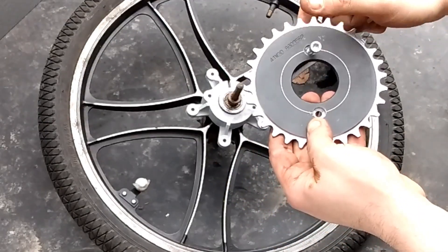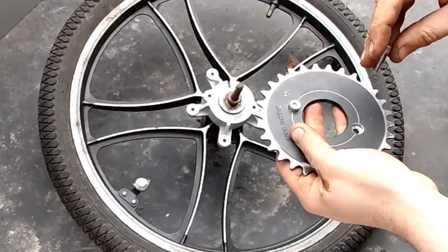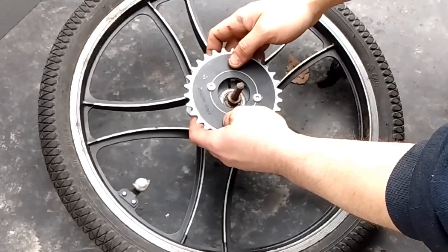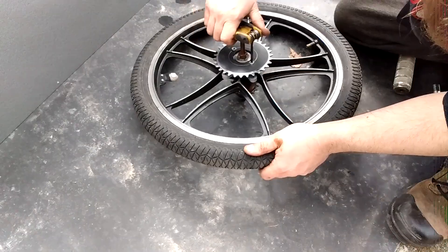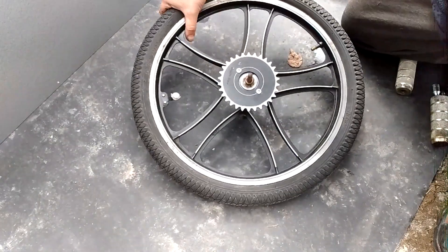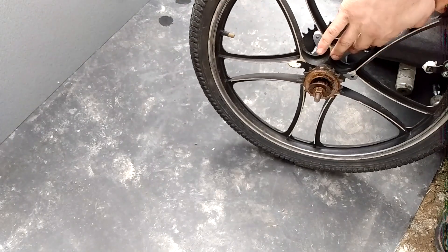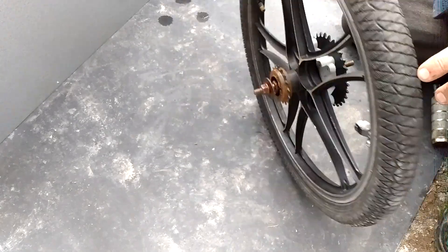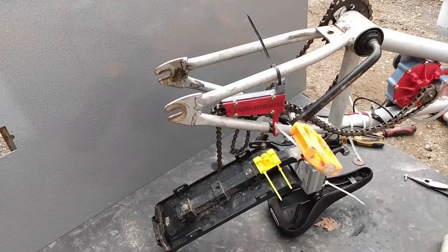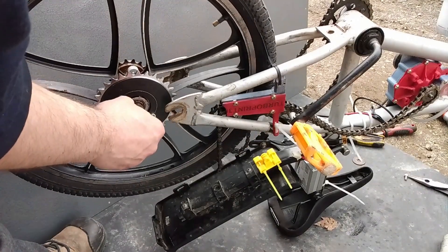When I set all of this up, I just kind of made it with what I had, and the final drive sprocket for the rear axle was a little bit too small. I didn't want to bother sourcing another one at the time. Now the weather has gotten decent enough to work on something like this and test it. I dug around looking for a sprocket for the rear end, but couldn't find anything for a reasonable price for the old school bike sprockets, which are half by one-eighth inch imperial. So what I ended up doing was getting a sprocket for a standard 41 chain and machining it down so the one-eighth chain will fit onto it.